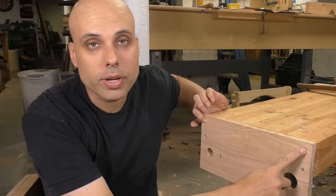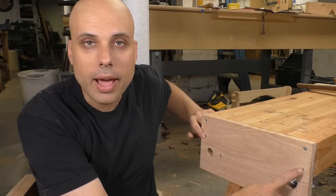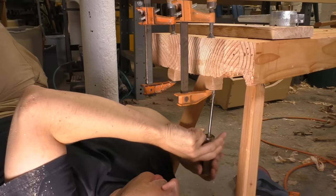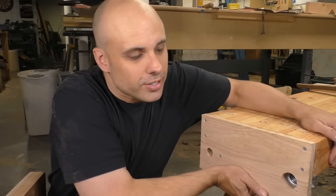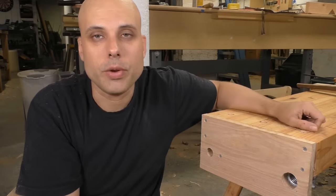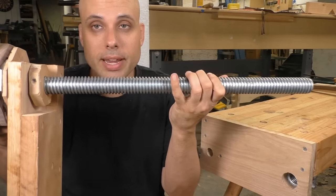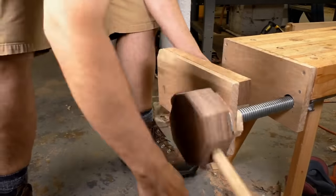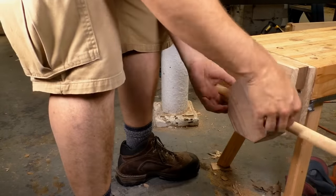Installing this vise is very straightforward. I started off with the two holes I had already drilled and ran fasteners into those, then did two more a little bit lower down. To make absolutely sure I had the strongest hold possible, I screwed a little hardwood block to the underside of the bench and ran a screw into that too. With those five fasteners, this thing is really, really solid on the bench — it's not going anywhere. Now I'm going to thread this screw into the nut and guide the dowel arm into its hole, screw the whole thing shut, and the vise assembly is complete.